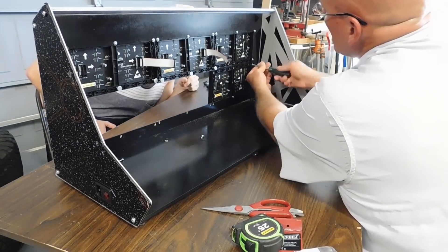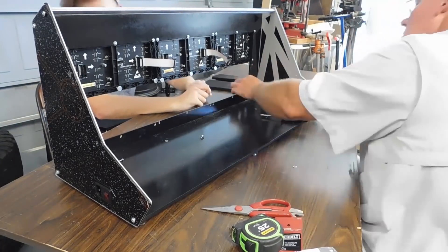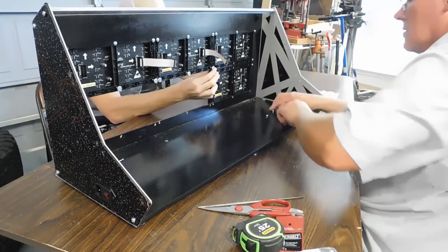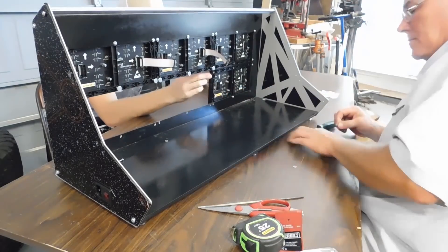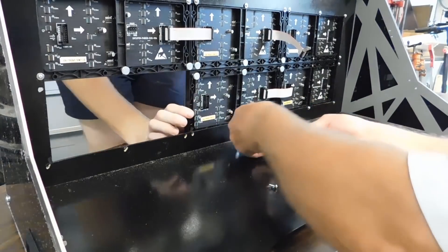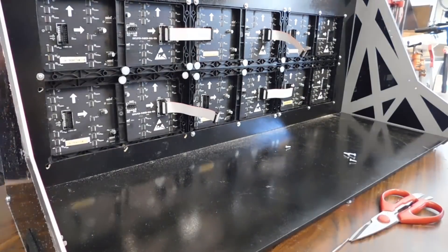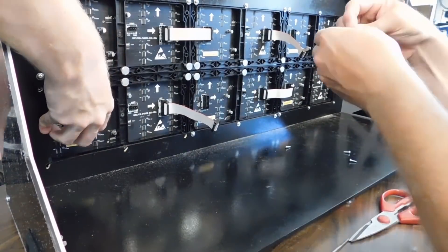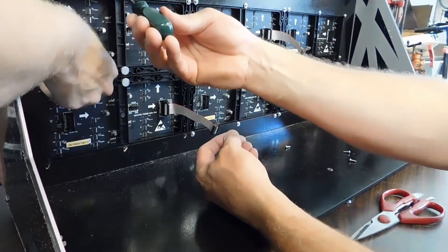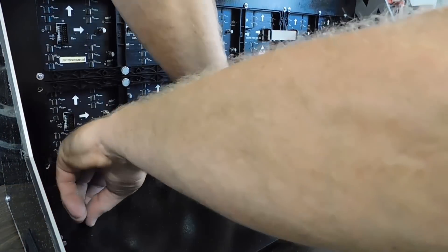The panels I used are P4 sized, meaning each individual pixel is 4mm in length and height. This is relatively small and geared mainly towards indoor use. Pixel sizing can go as small as 1.9mm pitch, but these panels can get very expensive, and you might be better served using an LCD screen for higher definition. These are also 1/16 scan panels, meaning only a sixteenth of the panel is illuminated at one time. These panels refresh so quickly that the naked eye doesn't notice, but they can look a little shaky when recorded by a camera. I wanted this screen to look like a retro Gameboy screen, so P4 and 1/16th scan was just fine for me. If you want full color, make sure to avoid single color panels and controllers using the Hub12 and Hub08 interface — these will not give you full color capability, but they do tend to be cheaper.